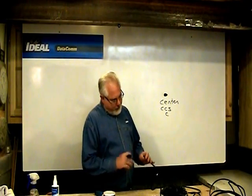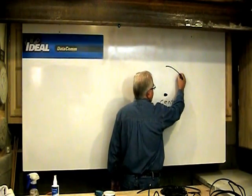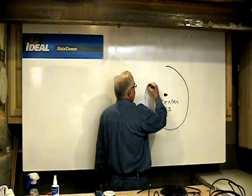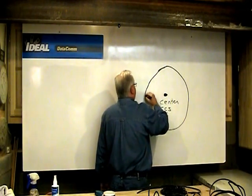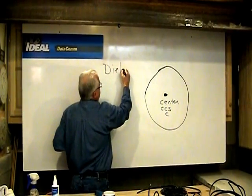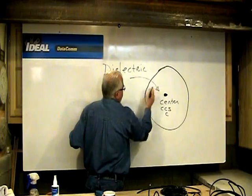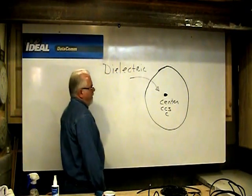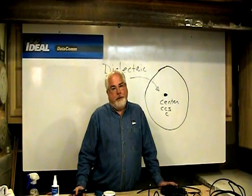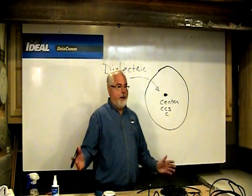The next thing you'll see inside the cable is a white material called the dielectric. The best dielectric in the world is air, but we can't use air here. The second conductor is a foil that wraps tightly around the dielectric — in many cases the foil and dielectric are glued or bonded together. The main purpose of the dielectric is to keep the two conductors — the foil and braid, and the center conductor — the exact same distance apart throughout the length of the wire.